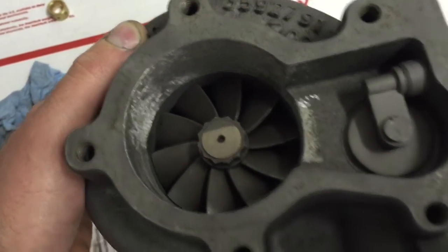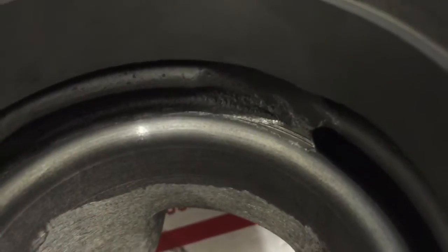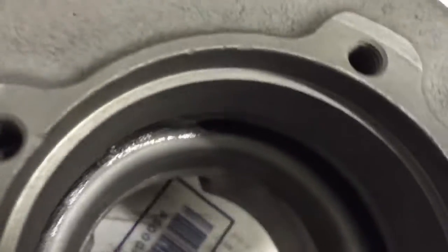This is a 67 by 76 turbine. If you don't know anyone that can do the machining for it, we can do it for you. I did have to trim some of the edges on the inside. That is the downside of the HX35 turbine housing being machined. Most of the housings you don't have to do that, but I think it's just the 12 cm that causes that issue.